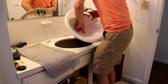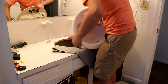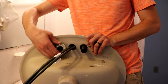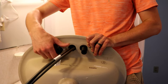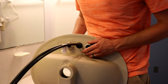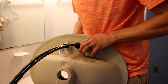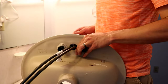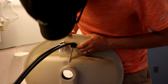When you do put your faucet in place, be sure to put the plastic plate that goes between the faucet and the sink — make sure you have that on there and orient it in the right direction. Now we can just tighten down our nuts on the sink for the faucet. Both of those just go hand tight; you can put a wrench or a pair of pliers on them if you want to, but don't go overly snug — you can break those plastic fittings. Before I tighten these faucet nuts all the way down, I'm just going to grab the rod for the stopper that goes through from the top down and operates the stopper plunger, and just run that through to make sure there's room for it and everything clears just fine. And it does.